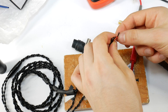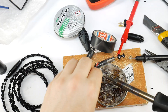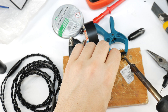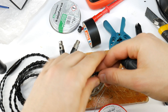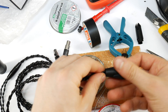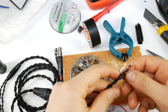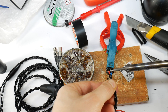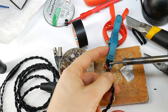Then mark the left and right channel signal wires with some adhesive tape, and tin all the wires. Also tin the XLR connector contacts — this will improve the solder quality. Then remove all heat shrink tubing; it will be better to put the XLR housing on the cable first, then put back all 3 heat shrink tubings. Then solder the wires to the 4-pin XLR connector using the correct wiring, so that everything works correctly and the headphones will sound much better after this mod.